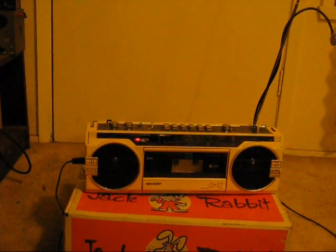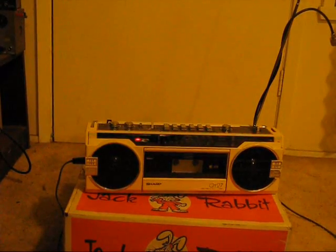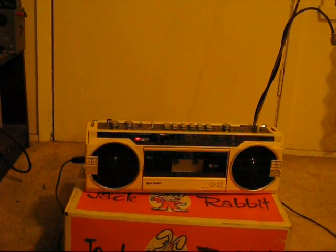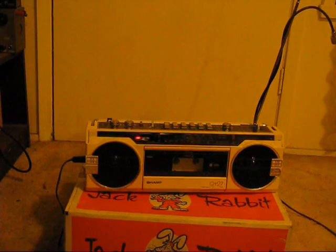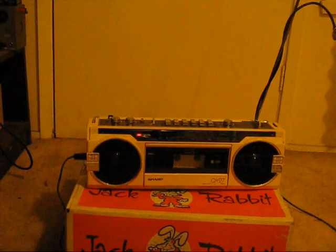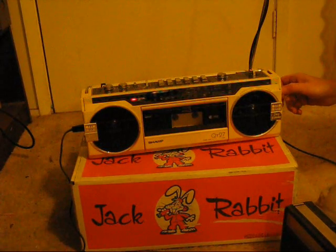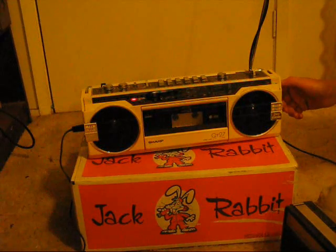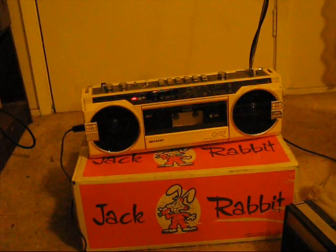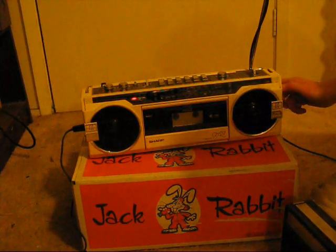If you've got a few metres of wire, connect that to the telescopic antenna on the radio and put it up into a tree. That improves the radio sensitivity. Remember, amateur signals are a lot weaker than broadcast stations. Tune the dial around 3.5 or 7 MHz. 3.5 is better at night, while 7 MHz might be more active in the daytime. Around early morning or late afternoon, there might be activity on both bands.